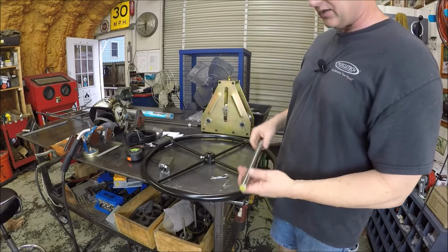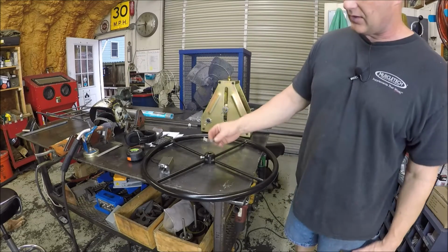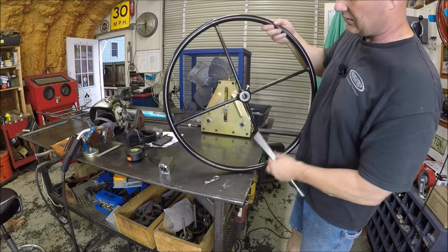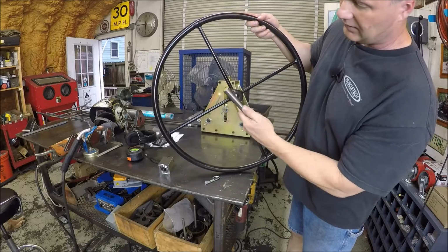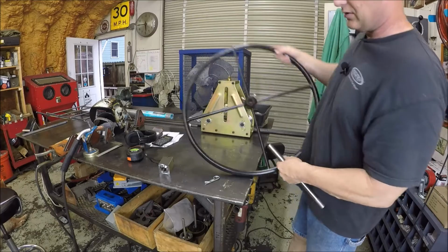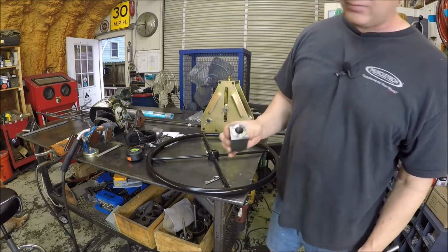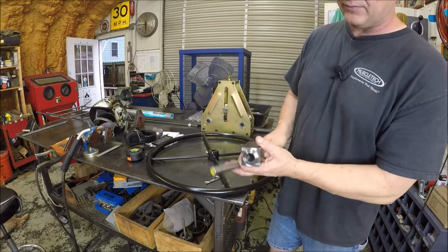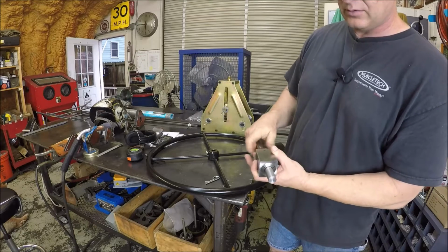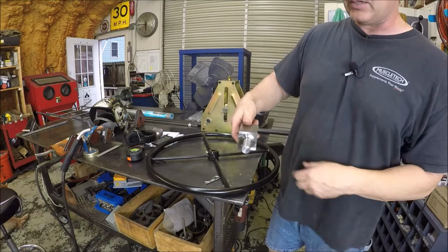So now the plan of attack is we've got to drill a hole so I can have the pin go in, and then the hand wheel's got the two screws to cinch down on this rod, and they're 90 degrees apart, so that makes it real easy. So I've just got my collet block and my 5C 20 mil collet. So this is going to go in, and then we can just mill this flat, and then we can just turn her and mill the flat again.